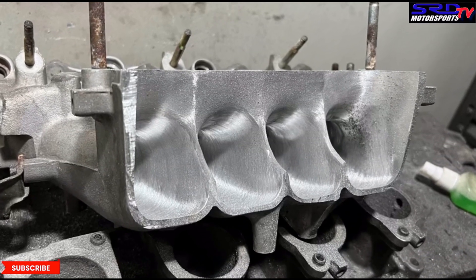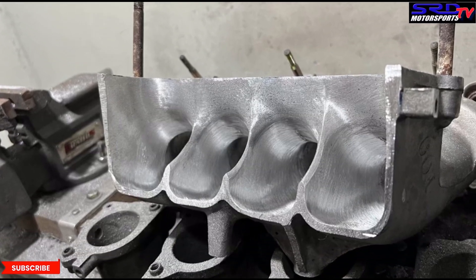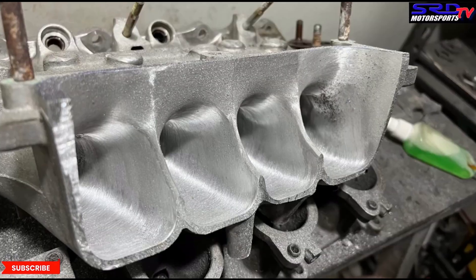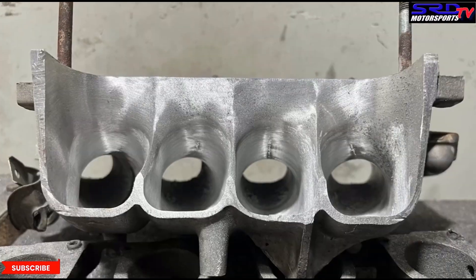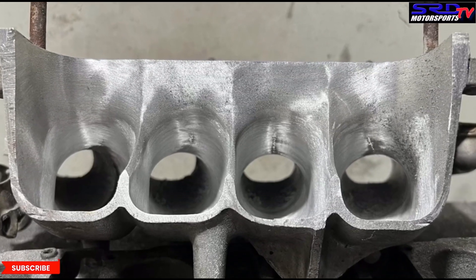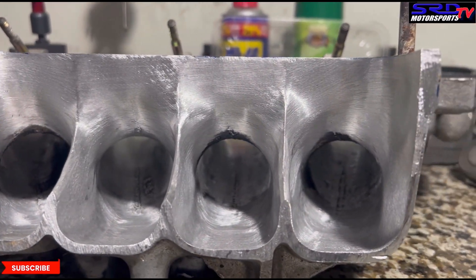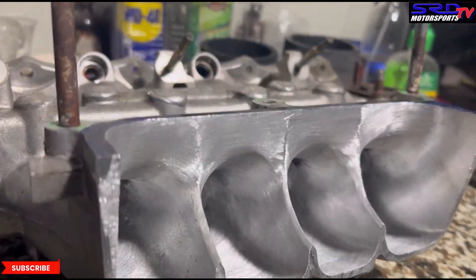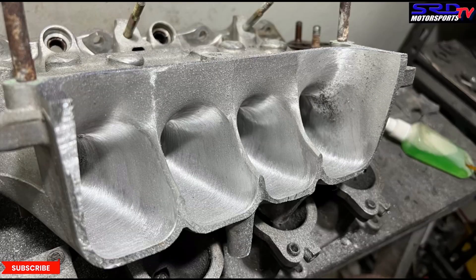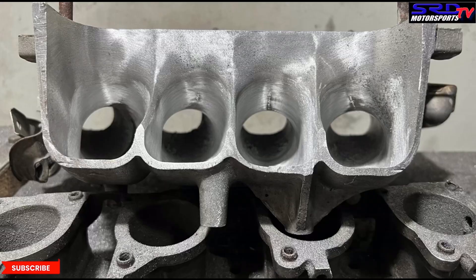The finish is really good — all done with just 80 grit, which shows how important the ethyl alcohol and Joy dishwashing soap mix is. You may not even need to go up to 120 grit to get this finish — just proper lubrication. The short turn still needs a little more work with some casting marks remaining, but compare it to the raw texture when we first chopped it off. Light don't lie — the reflection of the curves is still good, but it needs another round.